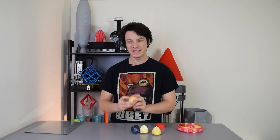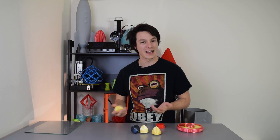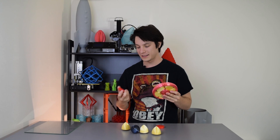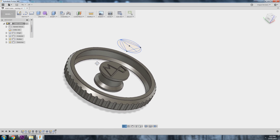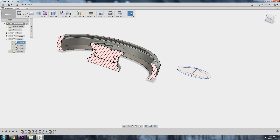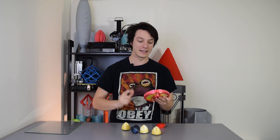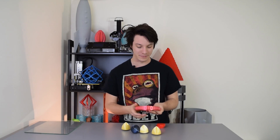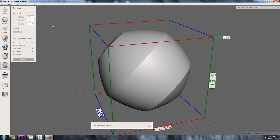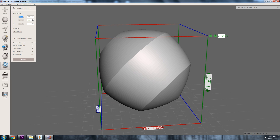My biggest request in that video was if you could make a ball bearing from them. At first it seems reasonable — if they roll like a sphere under an object and the top to bottom distance is always the same, why shouldn't you be able to make a ball bearing? You'll notice this thing here has a flat object — it's essentially a 2D version of the solids of constant width. I drew this up in Fusion 360. The idea was to draw up basically a roller bearing using the solids of constant width in a way that's 3D printable. I'll put this file up for free in the link if you care to print it. First things first: calculating what that distance is for these objects. With an STL file you can just set the XYZ scale to whatever you want and it will always be that distance from top to bottom.